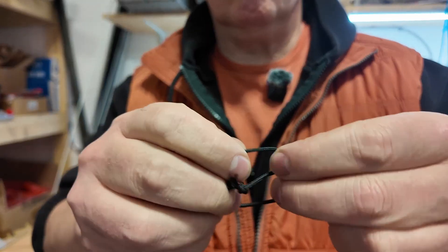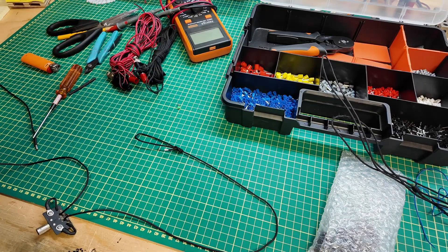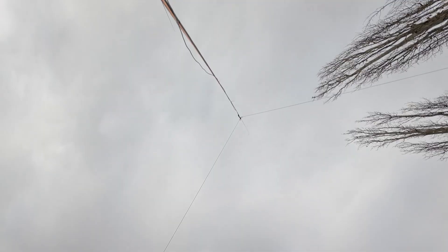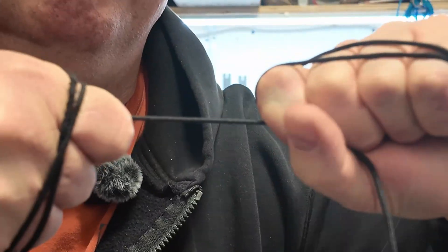This stuff is not paracord, it's not lined with a wire in it, it's stronger than paracord. It's not flex weave — it is a structural cord and it will conduct end-to-end. You can build end-feds, dipoles, pretty much anything that you can stuff a wire on, you can use this. The advantage to it is that it has a 300-pound breaking strength, and that opens up a few opportunities that weren't necessarily available to you before when you're making an antenna.